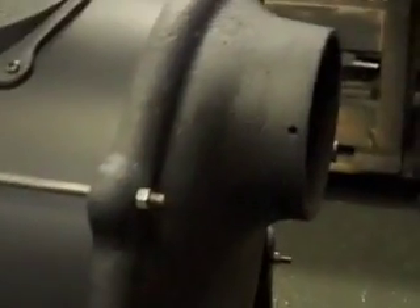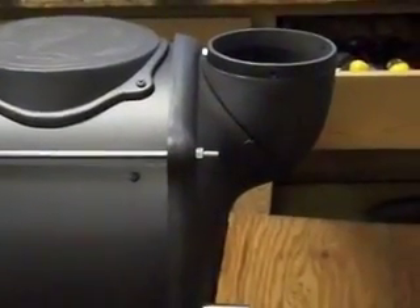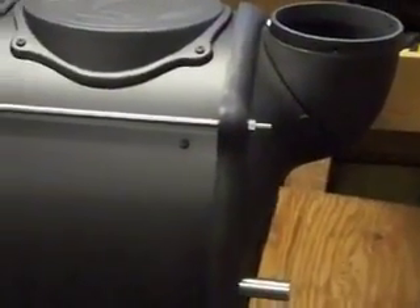And on the back of the stove, this is an interesting detail — Vermont Iron Elm Back. And the letters were actually individually carved. Nowadays you can buy pattern letters, which are perfect, but those were hand made. On the rear of the stove, the 6 inch flue exit comes straight out, unlike the newer ones where it's actually a 45 degree rotating elbow — a two piece setup with a separate cast iron elbow and back assembly.